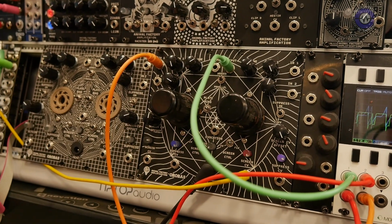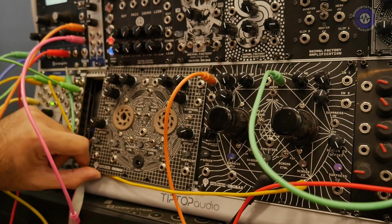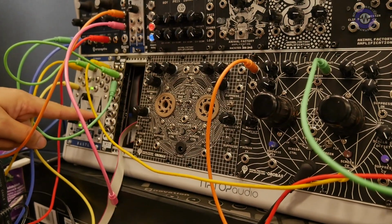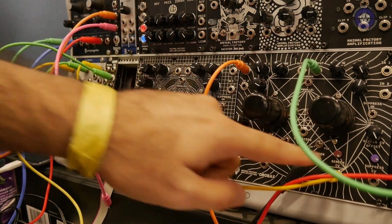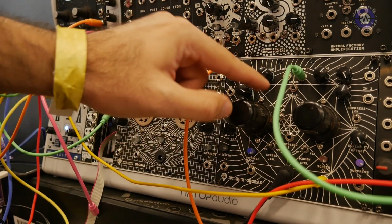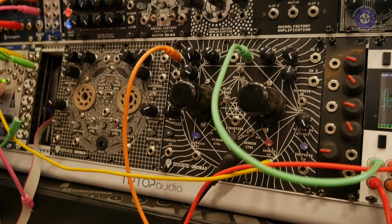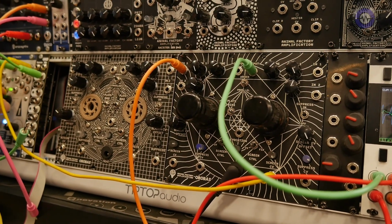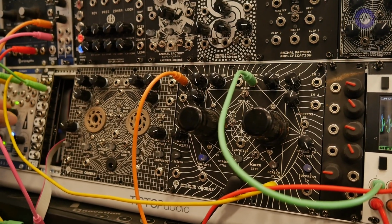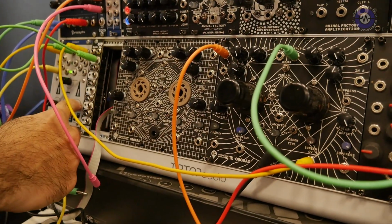Right now, everything's fixed, but let's say you were to feed in a control voltage signal, like I have a small, oops, this one's a little loose. I have a small ADSR signal coming in here. And now it is operating as a VCA of sorts. And I guess almost because it's tube and saturated, you could actually change the timbre of it as the envelope changes a little bit. Very much so, because right now I have a slow attack envelope that's coming in.